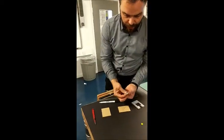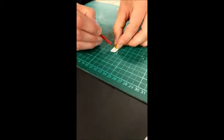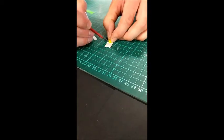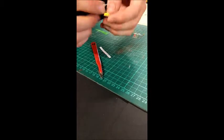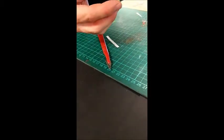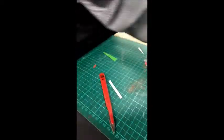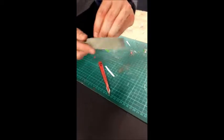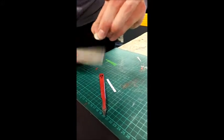I'm going to get some double-sided tape and cut a piece slightly bigger than the actual product I'm putting in, then cut around the outside using the craft knife. This is a bit trickier because I'm moving the product as I cut. I'm holding it at a slight angle pointing toward the bottom so I don't get any excess tape around the outside, then carefully peel it off. As an extra quality assurance measure, if there are any loose fibres around the outside, I'll file downwards at a slight angle — you can see very small fibres of double-sided tape coming off around the outside of the product.